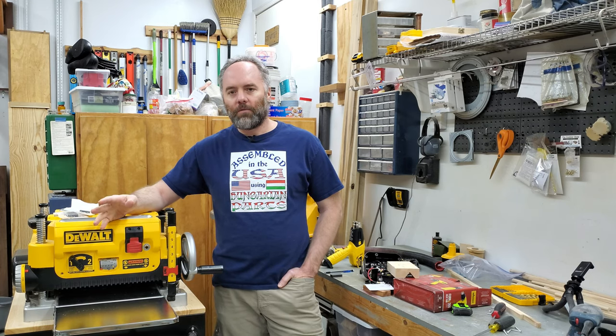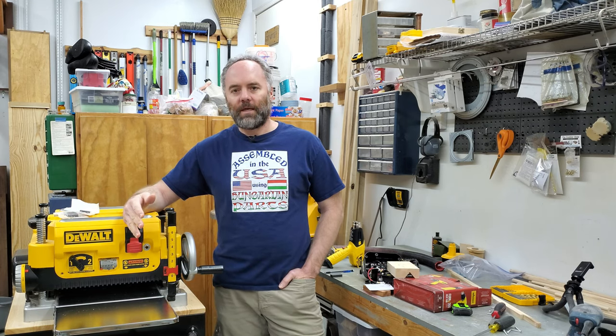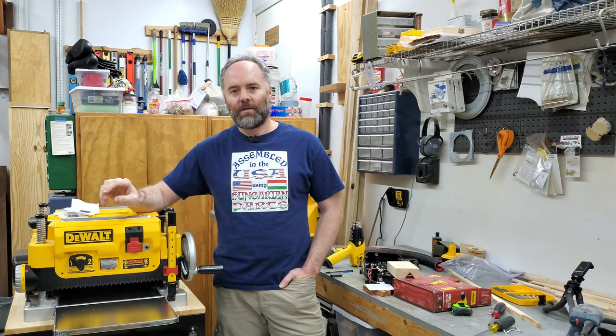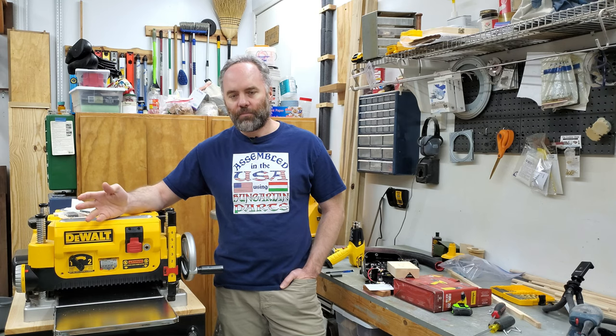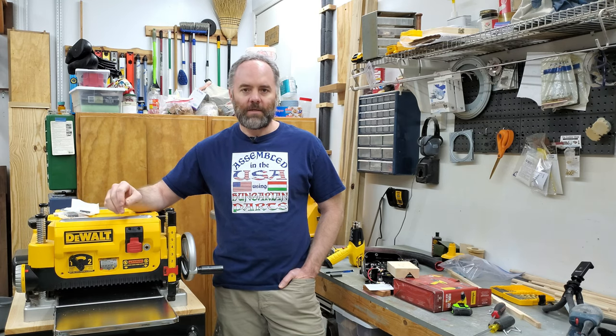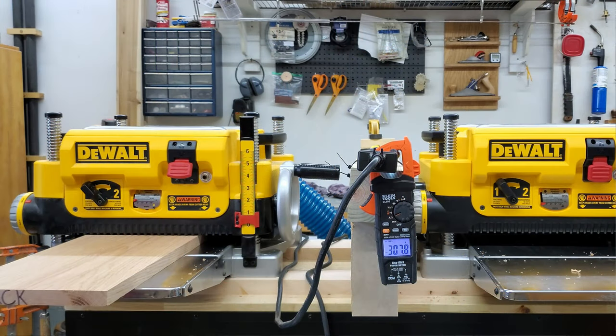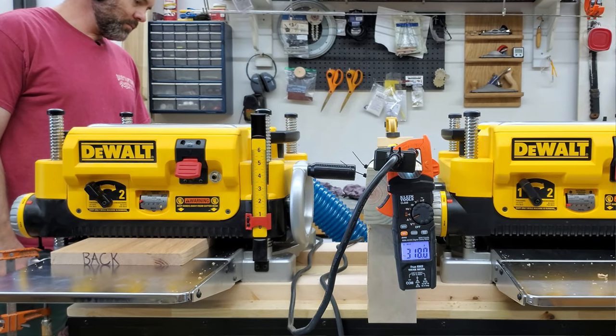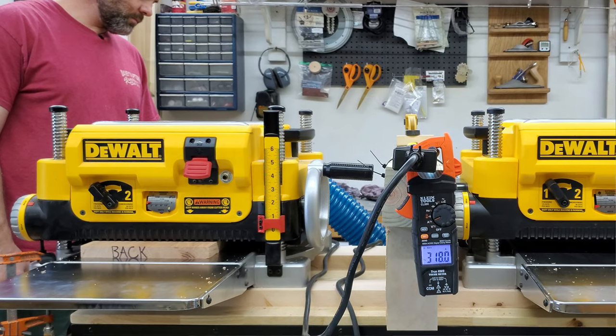Well, I'm not going to go over everything again because it's been covered at great length in other videos and in the comments of those videos, but the short version is that everybody who has repeated the same test using the same planer, the same type of meter, the same width and density of wood has come up with pretty much the same results. So yes, this planer draws a lot of power, but what really caught a lot of people's attention was that it didn't trip the circuit breaker in the wall, even though it was well over the rated amperage for the outlet and the breaker that I was on.